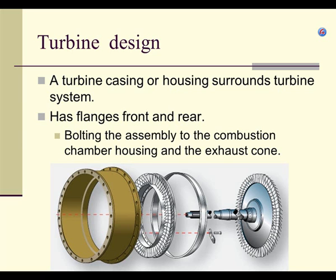The housing has flanges so it can be bolted to the engine — everything is bolted in chunks and sections. Interestingly, if you take two engines of the same model but different dash numbers, one might be slightly longer. When you get to the turbine section, there will simply be one more ring — one more stage. These engines are truly modular that way.